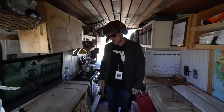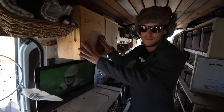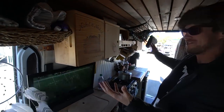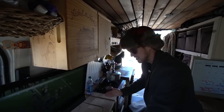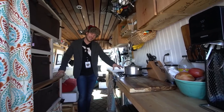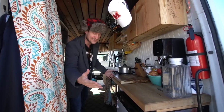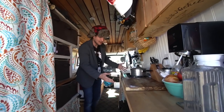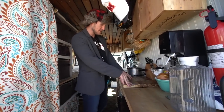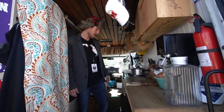Moving down to the kitchen, we've got all old IKEA wood blocks that we just took what we had and modified it. We had these wine boxes above our apartment oven back home in Orlando, and we just added some doors for the ones that needed doors. We wanted the wood to have a story — everything in here is recycled. For instance, this IKEA wood block right here we just cut a hole in it to drop the sink in. Six gallon jugs in here and two pumps, and boom, we got a sink. We took an old IKEA wood block and cut the top, slid it over our refrigerator, and that gives us space to fit this two-burner stove and enough space to fit the 20-pound LP in between the two systems. That gives us a rounded-out kitchen with enough countertop space to prep our vegetables and food and still have areas to cook.